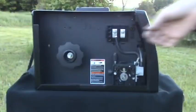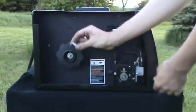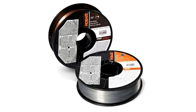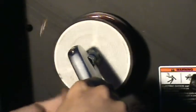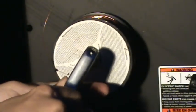To install the roll of wire, first you will need to remove the nut. Use a spring and a washer, then the spool adapter comes off. Now put on the spool so that the wire comes off of the bottom. Some spools have a larger hole and use the spool adapter. Replace the washer, spring, and nut in the order which they were removed. Set the spring tension as shown here. The spool should just come to a stop. Not enough tension can cause the wire to unroll as the spool keeps spinning. Too much tension can cause the wire to stop feeding.